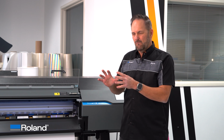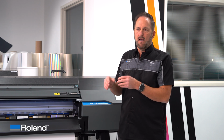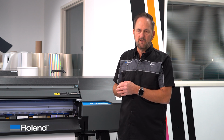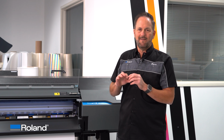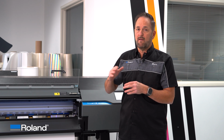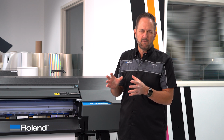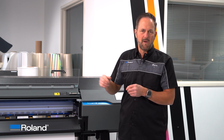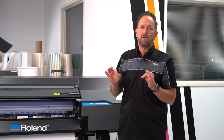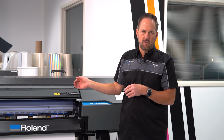Again, and I'll re-emphasize this, think about the quality of the material that you're running. I've known so many times in the history of working through these types of machines where the quality of the material means everything. So consider what you're buying, perhaps maybe spend a little more and try an alternate material. Honestly, it's your best bet sometimes. So when you really have those trouble situations, you may have to move to some other manufacturer, better quality liners that have more rigidity. That always helps, period. The more rigid the material is, the better chance you're going to have of it tracking perfectly.